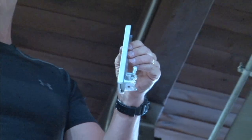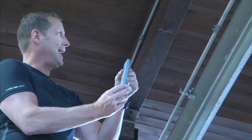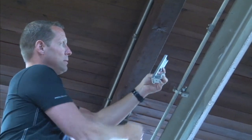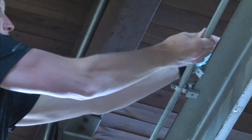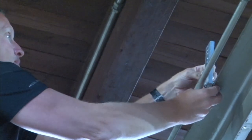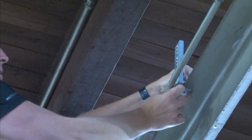Now, you can sneak this particular elevated raceway behind the existing conduit run that is already on the beam. By loosening the clamp, you simply sneak it behind the pre-existing conduit and raise it up like so. You then tighten down the beam clamp so it fits very snugly to create a nice support for your raceway.